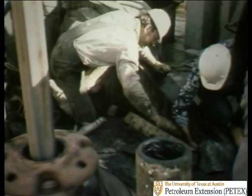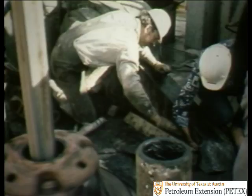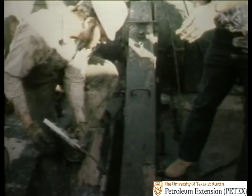When the drilling supervisor removed it, the floor hand could see that the grease fitting for the pinion shaft seals was covered by this hinged plate, which covers the gap between the end of the table frame and the rotary guard. The plate serves to prevent mud or tools from falling into the cellar. But it shouldn't prevent you from greasing the pinion shaft seals.